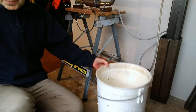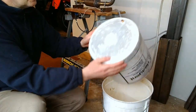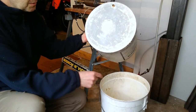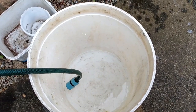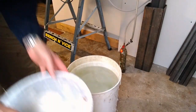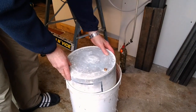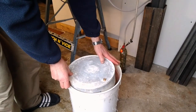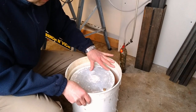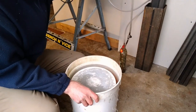The first thing I did was take a bucket, then get another bucket which I cut down a bit so it would fit inside. The first bucket I put a brass union on to connect the pipe to. The bucket gets filled with water to two or three inches below the top. You chuck in a lump of calcium carbide, which immediately starts bubbling producing acetylene gas. You put the top bucket in and push it down until all the air comes out — right down until the water comes out — and then any gas coming out is acetylene with no air in it.